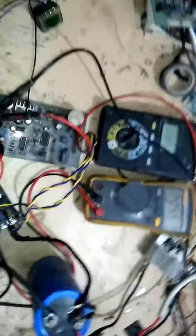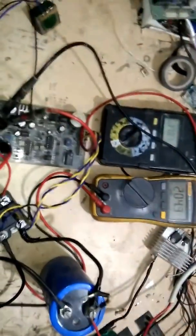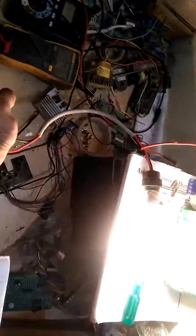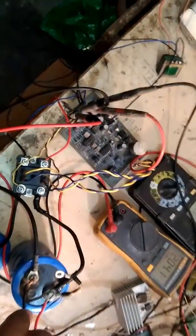Let's check the DC current using a clamp meter. Around 1.5 amperes DC is flowing through the SCR with this 200 watt load — because it is DC. If we were using AC voltage, the load would be around 200 to 300 milliamperes by comparison. So everything is okay.